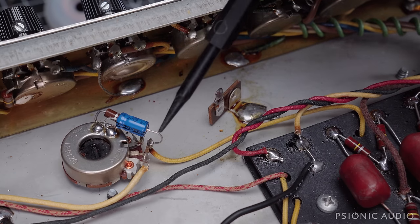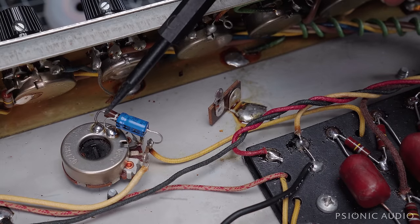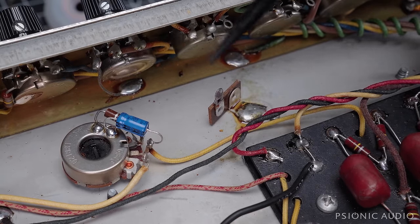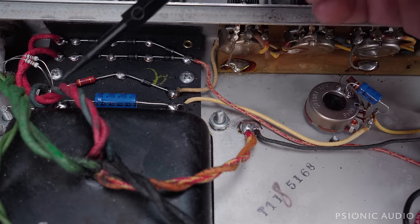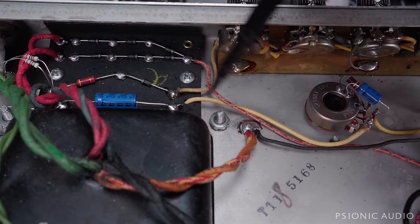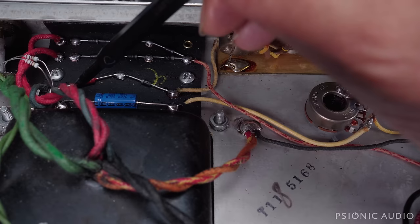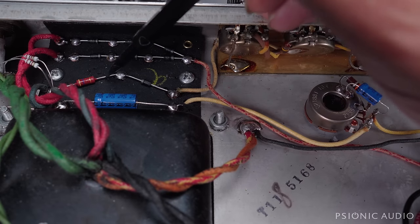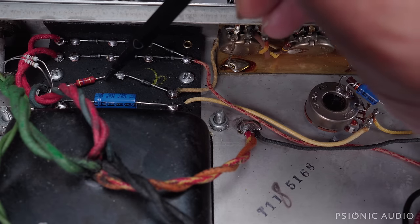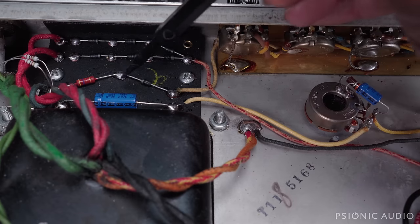Like on some other amps I've done recently, you can see an additional filter cap added to the bias, because the amp had a very low level hum in stock form and adding this made that hum go away. The AC secondary from the power transformer goes to this 470-ohm resistor — it was a 1K in the 68, and I've changed it back to the 470-ohm from the AB763. That very slightly lowers the AC voltage and gives you a little bit of current limiting. There's no real difference between 470-ohm and 1K in this circuit.